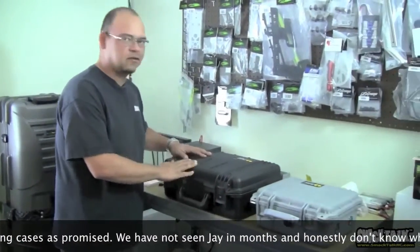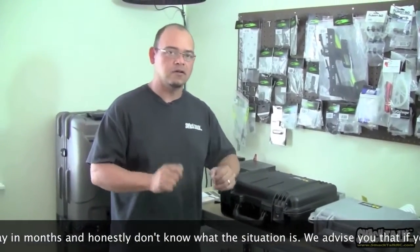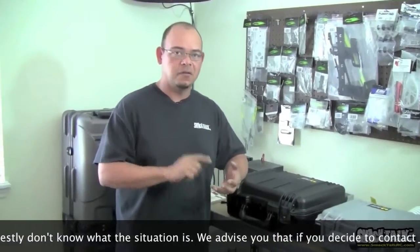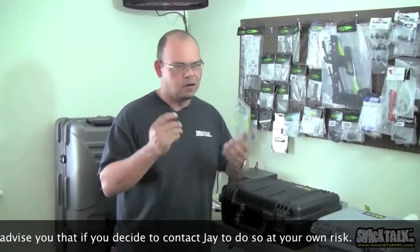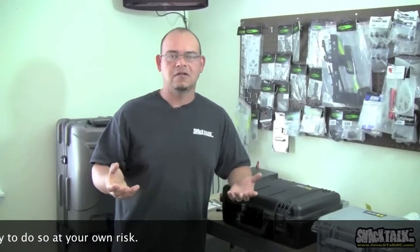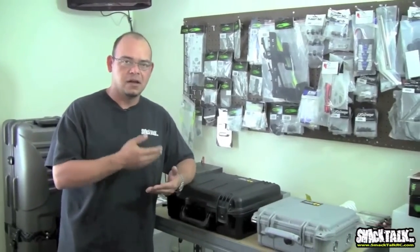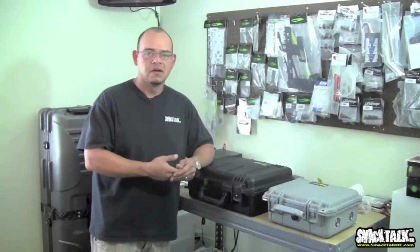First thing, when you buy a charger, make sure you're buying a charger that has the ability to charge at the rate you want to charge at, and that has the ability to charge the number of cells you have. I see people flying, for example, a Logo 600 with a 10S stick pack. They buy a charger that can only do 6S. Well, now you're in trouble. So a lot of these guys end up splitting the packs, and it just becomes a nightmare. Just make sure you buy a charger that can charge the number of cells you have and that has the capacity, the current, the power that you need.